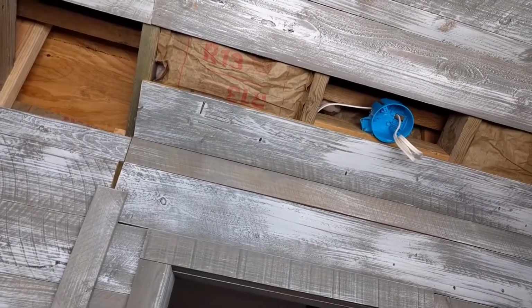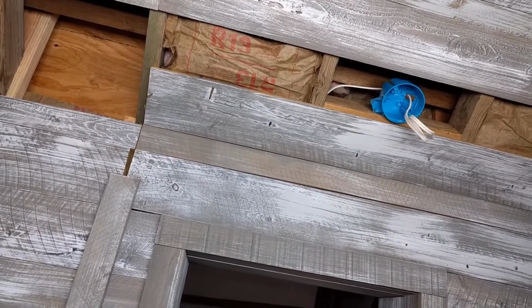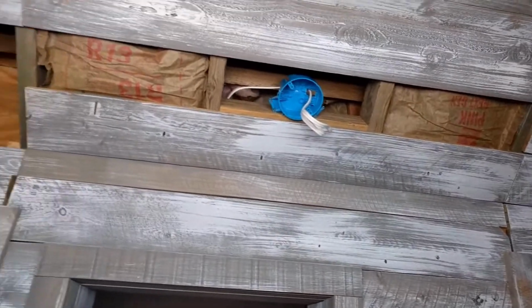And I also insulated that area up there too, but I did leave a little triangular airspace at the very top so air could pass through there. And right back there I went ahead and finished the little flat part, the 3-board wide area up there. And I had to trim that last center board down to 5 inches, so I had to cut a 1/2 inch off. So I may also cut this one to the right size. And I have them right down here on this table, waiting to put them in.